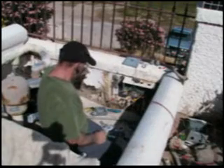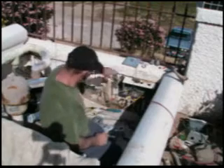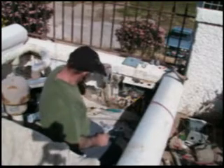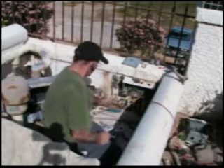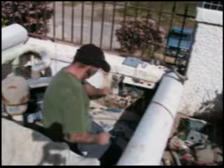I've eliminated these two low voltage transformers and taken off the wall the GFI that protected them. I'm going to reinstall a weatherproof box here and GFI protect it. And this other circuit — I don't know where it goes — but it's also going to be GFI protected on the way out.